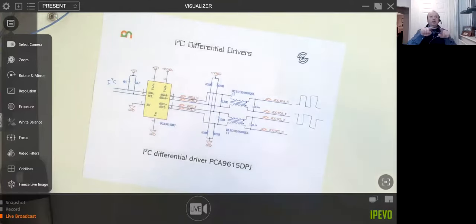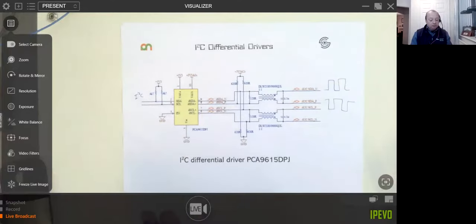So you could have two signals, and let's say you had a signal of, say, 5 volts, and you had noise on both of those signals of 1 volt. But the difference between them doesn't change. One might go up to 5 volts plus 1 volt, and the other one might be -5 plus 1 volt. So any noise has no effect on the data. That little trick will enable you to transmit over quite a long cable. As evidence of this, if you do a bit of digging around and look at RS422 and RS485, those are examples of differential data buses, where they're usually pretty bulletproof. I think with those two standards, you can probably run a kilometer of cable. So it's just a chip. You don't need to do any coding. Just get the chip, look at the application notes and copy it.